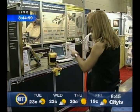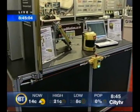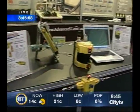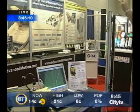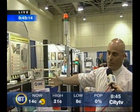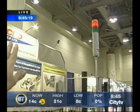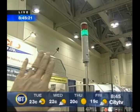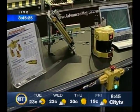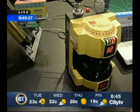Okay, so we're talking about keeping people safe. That's correct. What is this right here? What you're looking at are a bunch of machine control safety devices, and as an example, you would see a light curtain here, and this light curtain is creating an invisible beam. As you can see, we have green, which means it's a safe environment. If you were to break your hand into an unsafe area, it will indicate red. That same signal would be used by the machine controller to actually indicate to the work process something's wrong. There's some machines in there, and you don't want to go through this area.